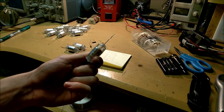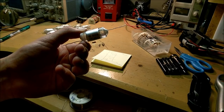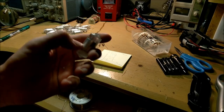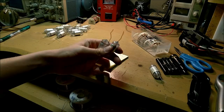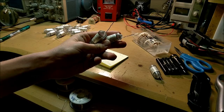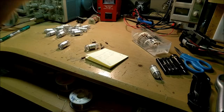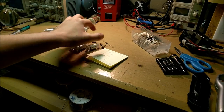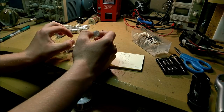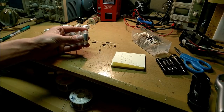These capacitors, as you may have seen in my previous video, were used in a Tesla coil capacitor bank, but they were not able to withstand all those charges and discharges, and they did not work that well. So these capacitors will function a lot better inside my Marx generator. These were Russian capacitors, and they're about 400 picofarads or 0.4 nanofarads, and these capacitors are rated at 15,000 volts. To build this simple three-stage Marx generator, I will use these five resistors and these three capacitors, and this should hopefully give us three times the input voltage of the ZVS driver, which will be really cool.